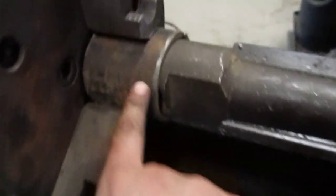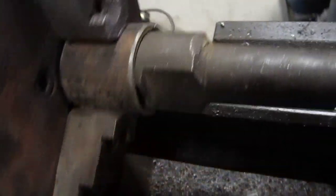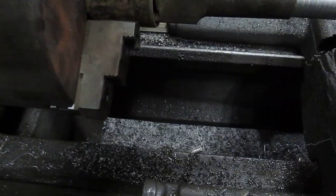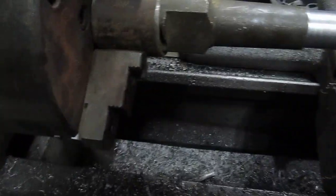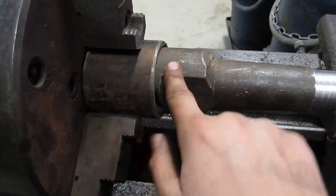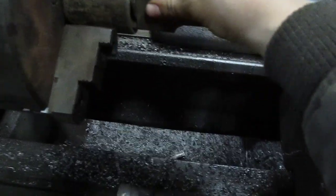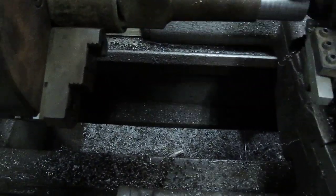To do so, what we did is we took this piece of tubing, and you can see right there — we torched around it to allow it to get a little smaller to tighten around this, because we couldn't tighten it around the bit. It could only get two points of contact at a time and not all three, so it was real loose.